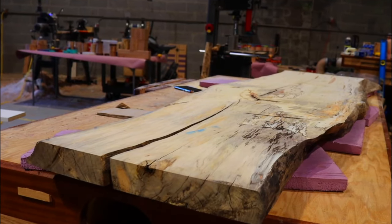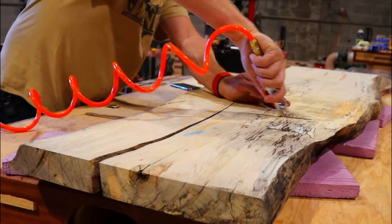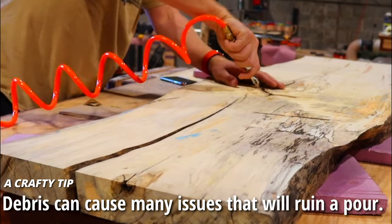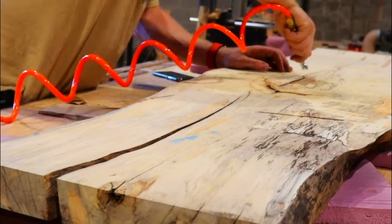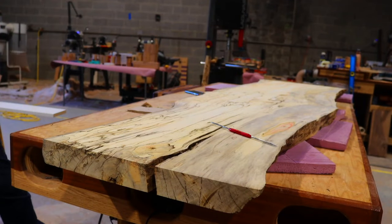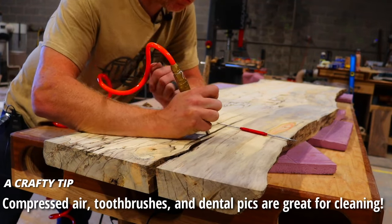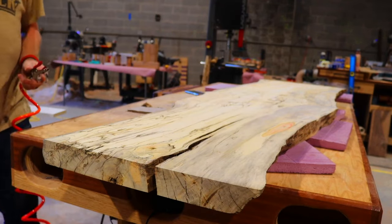In the top five most important things when stabilizing using epoxy is cleaning out all the crevices. The last thing you want is to do a translucent epoxy pour and find bark, dirt, debris, or even an old bug in your epoxy after it's cured. We use compressed air, dental or crafting picks, and even old toothbrushes to make sure all the cracks, crevices, and holes are clean before we commit to pouring.